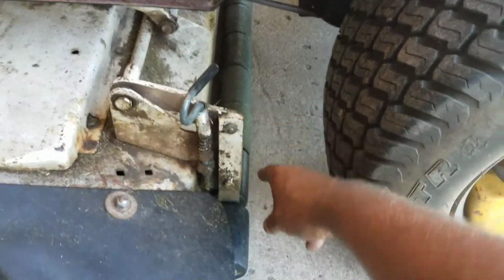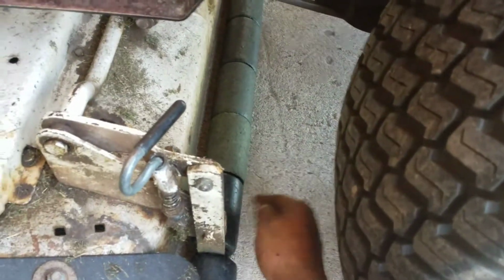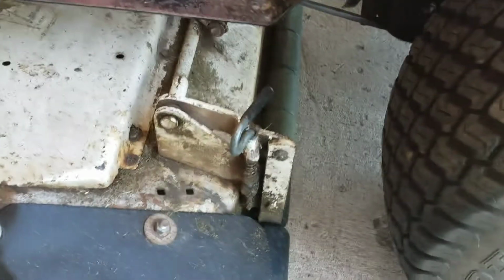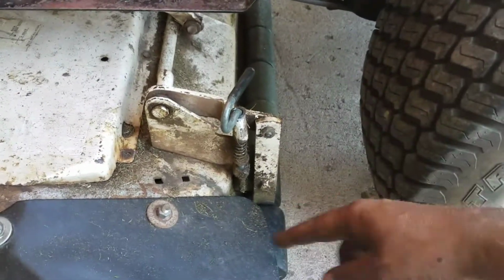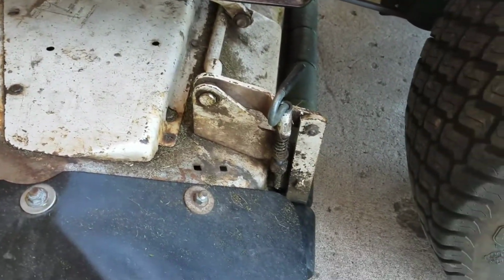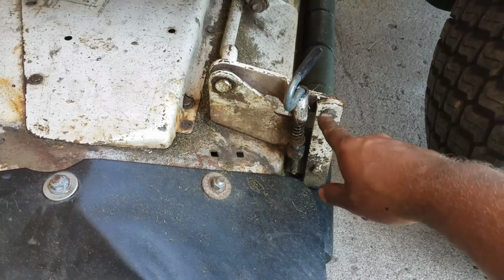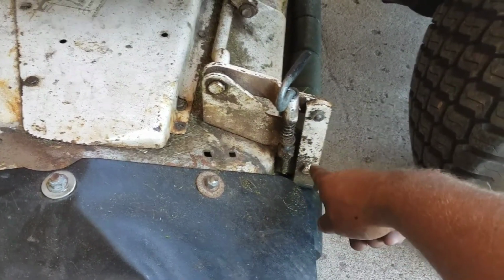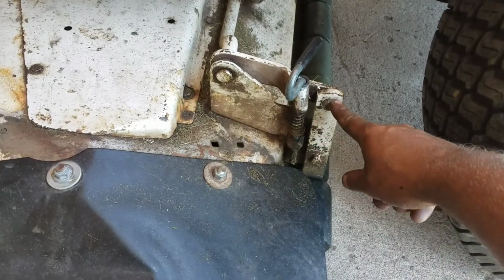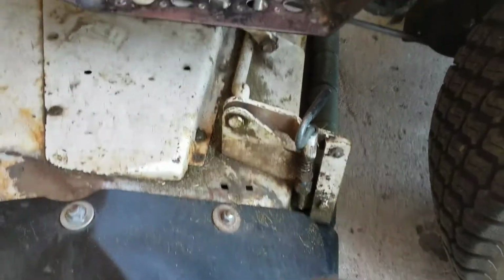I could have drilled holes, and I could have gone without this roller here. Could have taken that one out and have just the ones in the middle, but I'd rather have it the full width to take a little more load off of the fewer number of rollers. Different things like that. I also replaced the bolts on the top for both sides. This bolt's been replaced. That one is just in a slot, so that one doesn't need to be replaced, but this one had a lot of wear on it as well, so that would cause us to sit a little bit lower on this side.